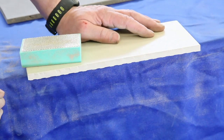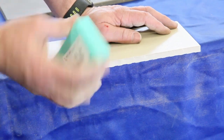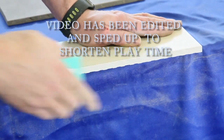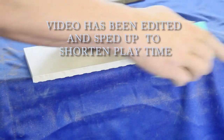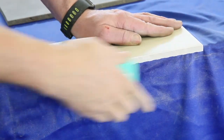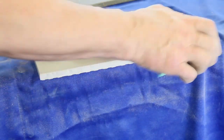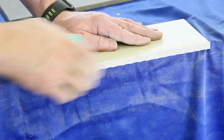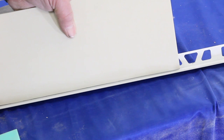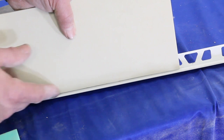Now we've got a piece of porcelain; we're going to go ahead and put the bevel on it as well using the 70 grit hand pad. You can see that even though we didn't polish the whole edge, we have a nice straight line when it meets the metal, and that's what we're looking for when putting that bevel back on there.